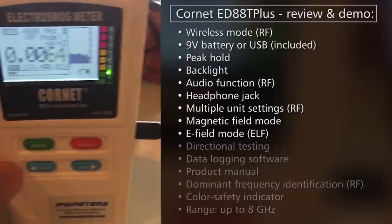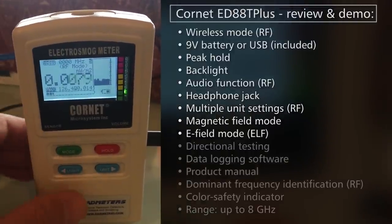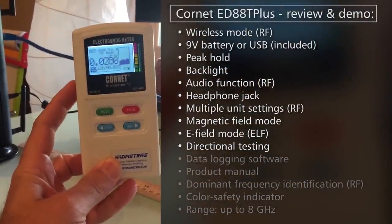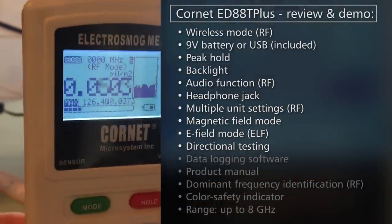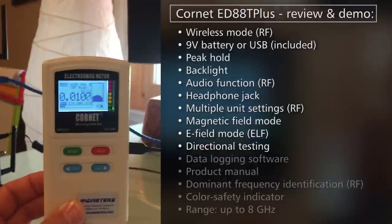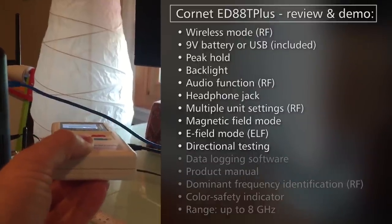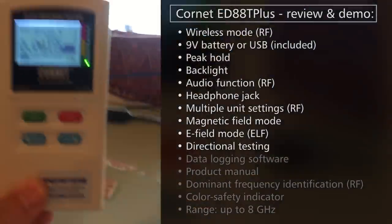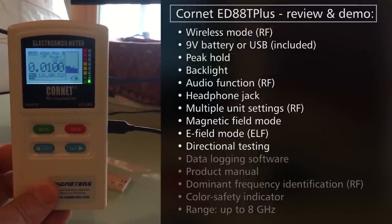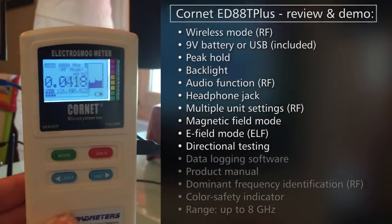We're going to focus predominantly on the wireless. For wireless, the antenna is on the left side here. You want to hold it vertical so that as much of the signal reaches the sensor as possible. If I tilt it horizontally, the readings are actually about 30 to 40 times less, because less of the wireless signal is hitting the sensor. That means you can functionally tell where radiation is coming from by moving the meter vertical or horizontal — the biggest readings will be when the meter is perpendicular to the source.